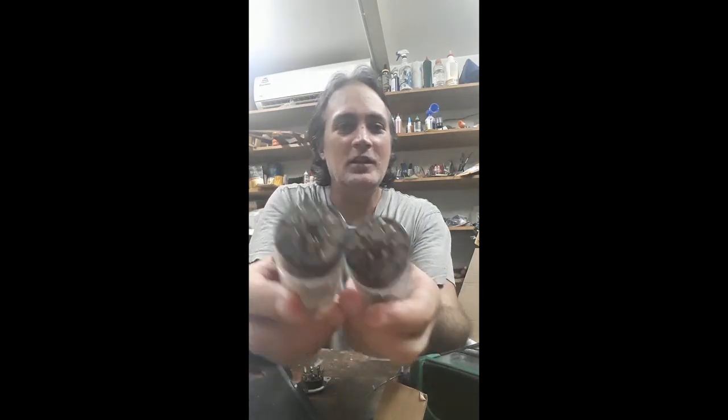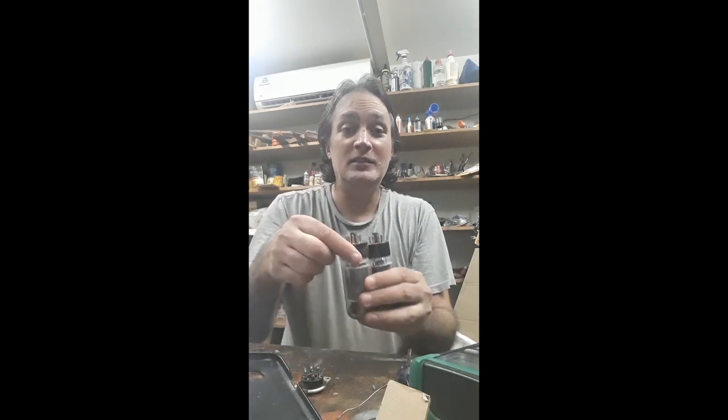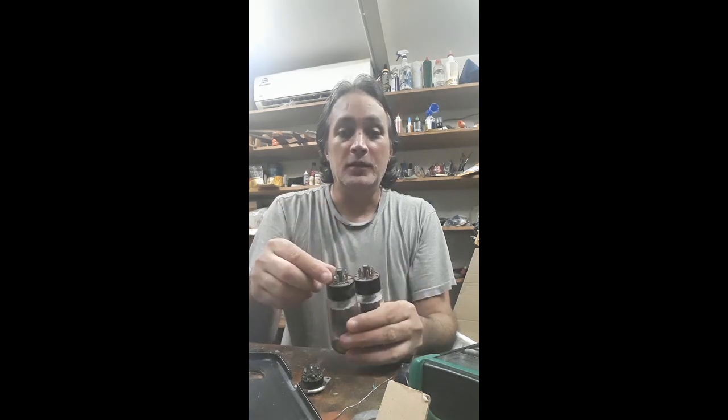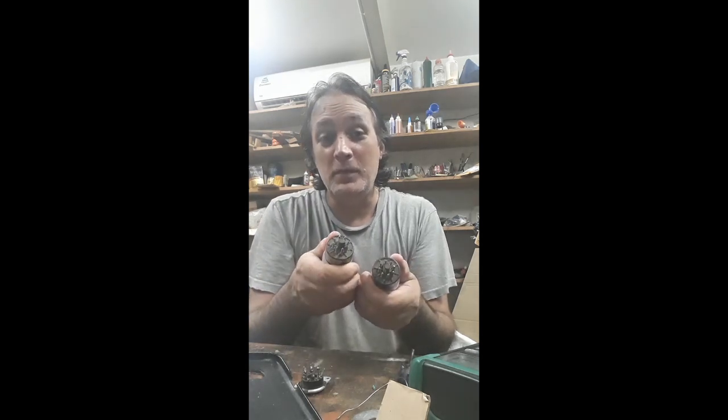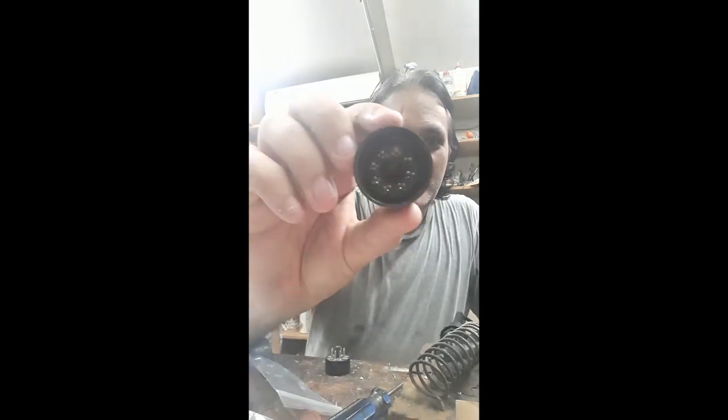Instead of wiring the internal diode setup that they had there, I'm going to take some old tubes, some old 6CA7s, which have all of the pins on the bottom here, take these off the bottle, and make these into plug-in solid state rectifiers. Of course you could just buy tube bases and make these from that, but I don't have that hanging around, and I have a bunch of old dead tubes that I could sacrifice the bases from, right? So I'm going to do that now. Well, I'm not really going to show you how I did that because it was pretty dangerous, right?